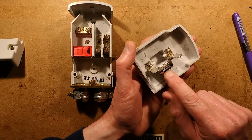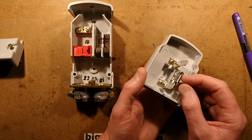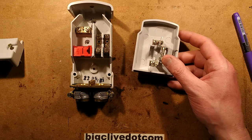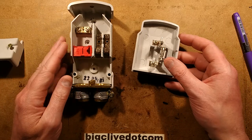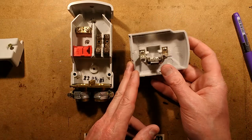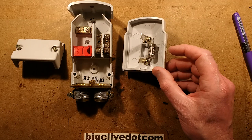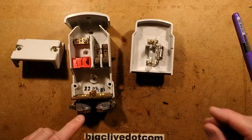Getting tingles in street lighting isn't that rare — it's just part and parcel of the job. I like these; they're really functional and neat. And once again I'll say: always replace this with the correct fuse. They're not that hard to get if you're working in the industry — just make sure you get plenty spare as a precaution, because it's not great when you run out of the exact fuse you need and the power is off. Always worth getting a good selection spare, so there's no temptation to bypass things or do silly stuff like shorting out fuses or bridging in inappropriate ones.